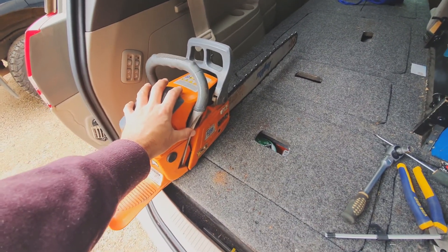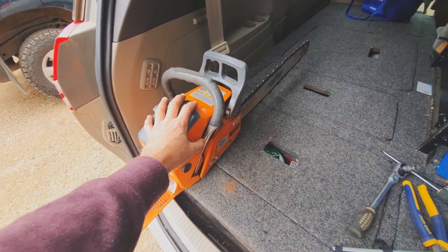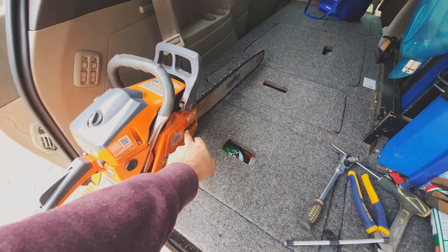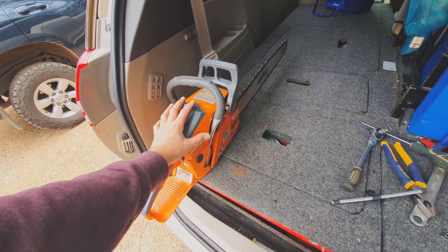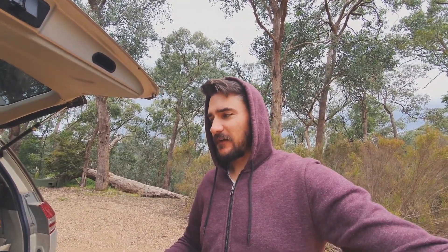I think we'll give that a go and see if it backs off with vibrations after running it for a while. The last one would run for about half an hour before the chain got too loose and would skip off. The downside is you're wearing your bar and chain out quickly when it's loose. If it loosens up after the first half hour, I'm going to order an oversized stud kit and tap those in. Sorry for the boring content with a heater that fixed itself and a saw that was running anyway. I probably over-tighten it a bit, but I do the same on my old Huskies and Stihls and haven't had problems there — probably not the strongest aluminium block. For now I've got a working heater and a saw, so I'm good. Alright, take it easy — see you in the next one.